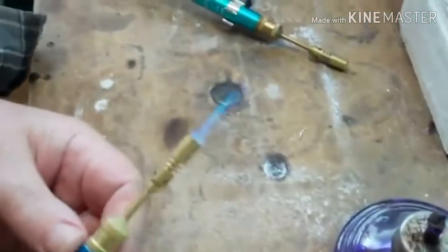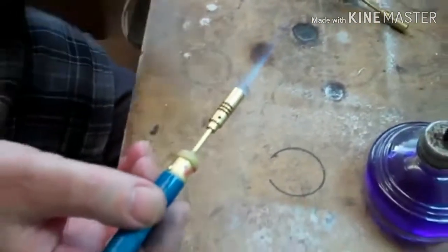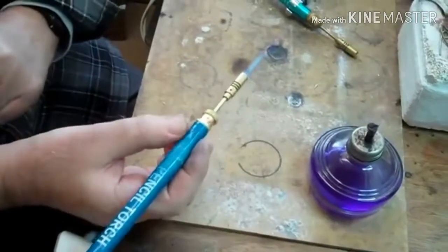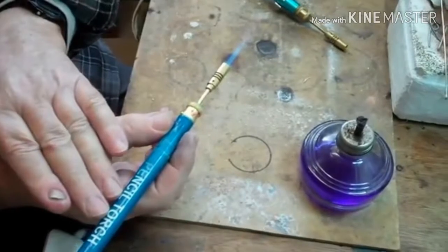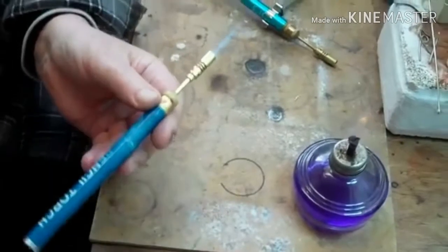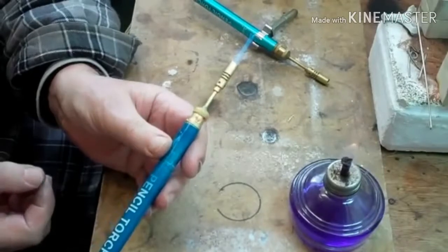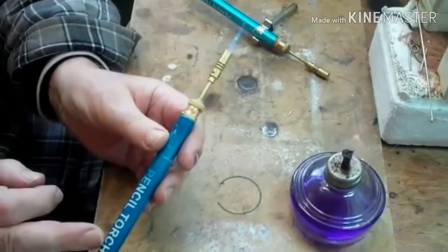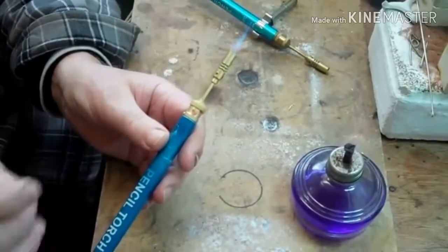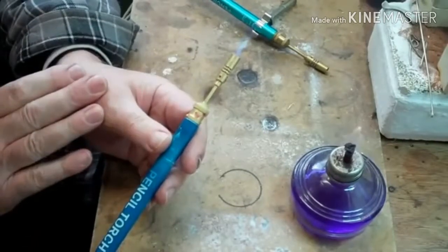you get a nice balanced little flame that's quite adequate for, say, closing jump rings and for doing small jewellery work. You've only got a few minutes life in the capacity of the gas. So you've got to be pumping it up with a lighter style gas filler. And the crunch is that if you buy cheap gas, the problem is that it contains contaminants, oily contaminants, sometimes even small solid particles, which get through eventually and block the jet.